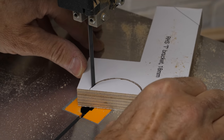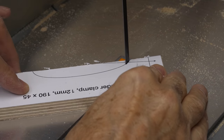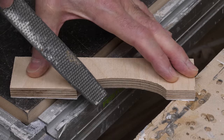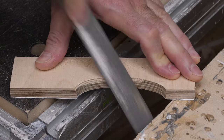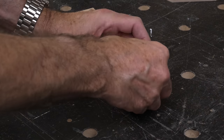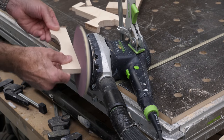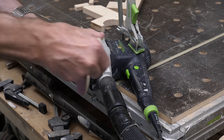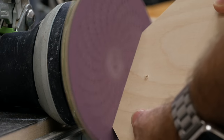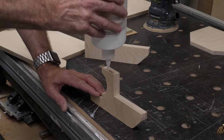The upright of the T also needs to be scooped out to accommodate the extractor hose. The clamping bar is 192 by 45mm and I've cut away a small section so it fits the curve of the sander body — you may also need to do a bit of work with the rasp. I've added little plywood uprights at either end: one to fit under the T-bar and the other to screw onto the L-bracket to hold the sander down. I'm spending a few minutes knocking off the bandsaw rash from the edges, paying particular attention to the sander clamp.